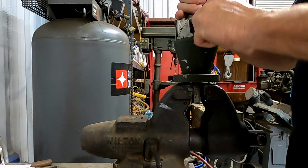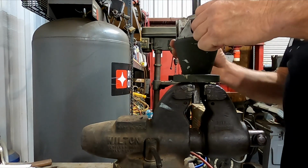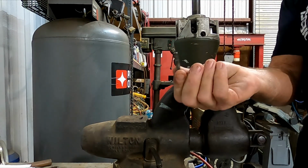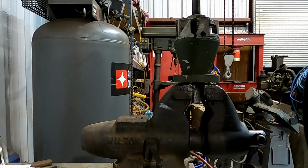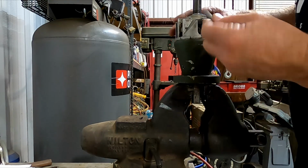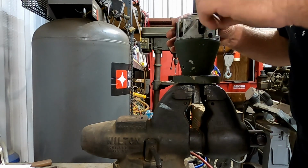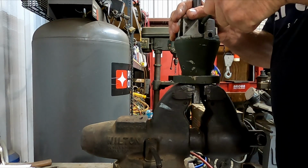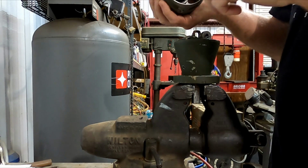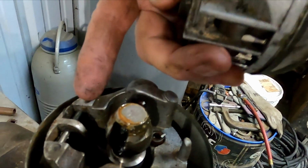And you just have to kind of lift up on here and wiggle it around to where it lines up with what you want to do. And the pin just came right out the back. So that's the pin that holds the two shafts together. And then once you get that pin out, you want to just rotate around so you can get to it. Screw the tilt lever stock back in there, and then you pull up on that, and that'll release the two dogs here where they lock on, for your tilt steering locks.